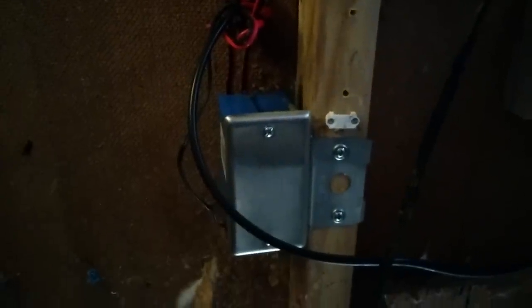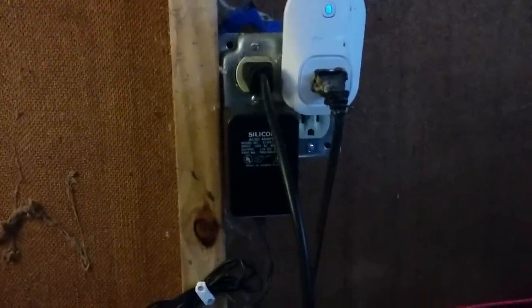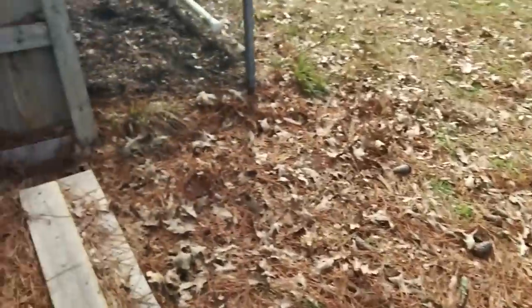Running back in, I enclosed it in this little box right here — the relay. I kind of had it run up to the switch. I was going to have that in the box too but the little snout was too short to stick to the wall, so I'm going to do something different about that. And then what I have is this power brick that's providing my 12 volts DC to operate the actuator, and then I have 110 running to the photo cell outside. Let's go outside here — I drew a little diagram of how the wiring works. It's crazy simple.